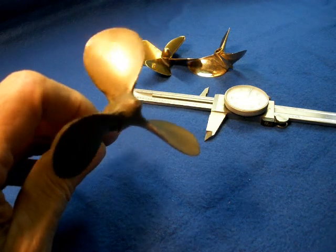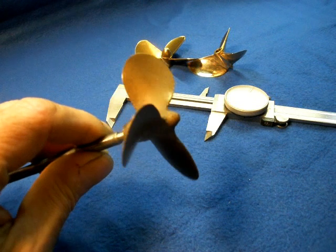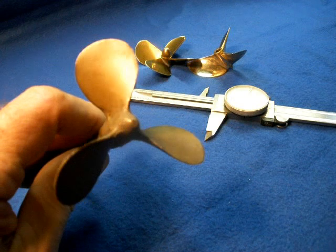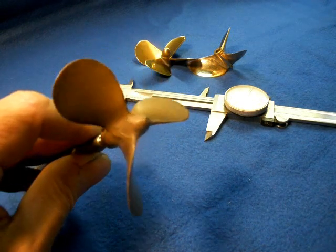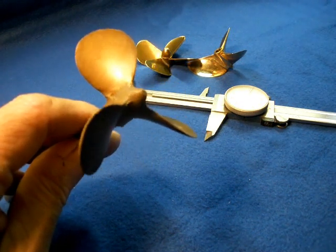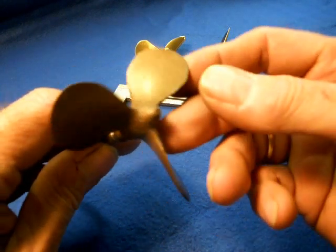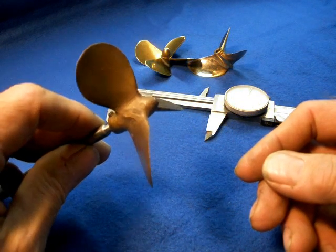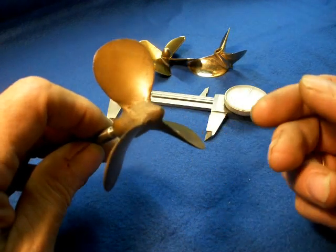This is just about the maximum that I can run on the Diana launch — that was one of my limiting factors. 3.2 inches is about the maximum prop that I can swing on there. This Kohl's 3-bladed turned 1,600 rpm, but that was at 80 psi, so it definitely loaded the engine more than the others. I just think it wasn't nearly as efficient.